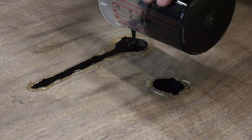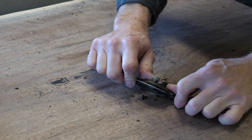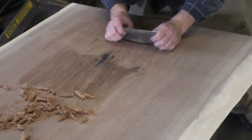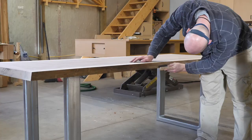There were a few small knots to deal with — I filled them with some more epoxy. All projects need some surface prep: I use a card scraper on the knots because it speeds along the sanding process. Follow that up with some sanding. I use a steel bristle brush to clean and slightly smooth all the live edges, and of course I ease all the sharp corners.